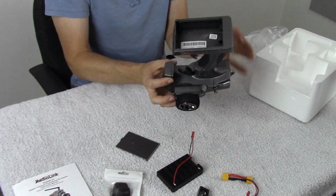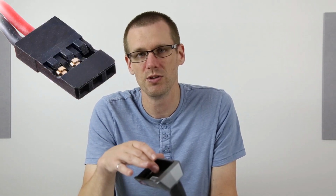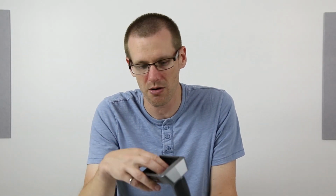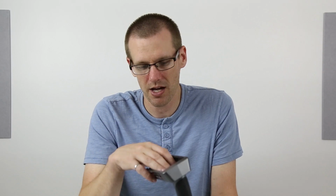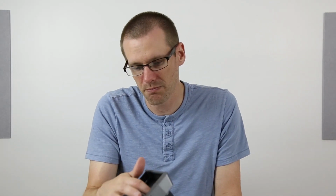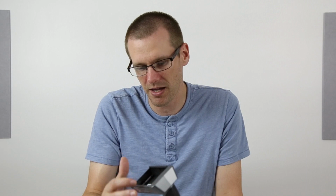And that specific connector can be used there. I'm probably going to rig something up so I can use a standard servo connector with a 2-cell, either lithium polymer battery pack or lithium ion battery pack. And this way I can use one connector to get my balance ports as well as get the main power. So if you're interested in seeing how I'm able to do that, let me know and I can make a video that talks about how that is done. It's not anything new, but it is something that I do like to use so I can simplify the connector that I'm able to use.